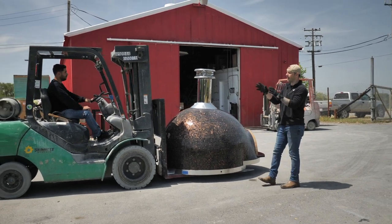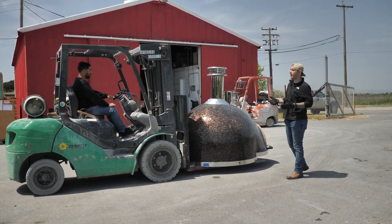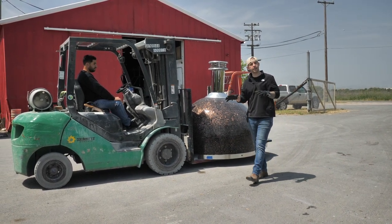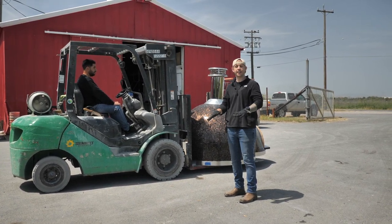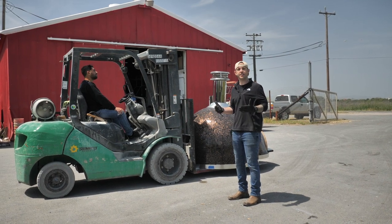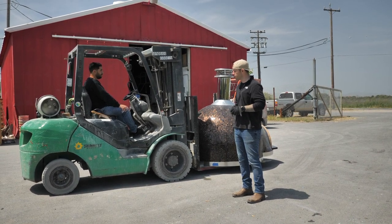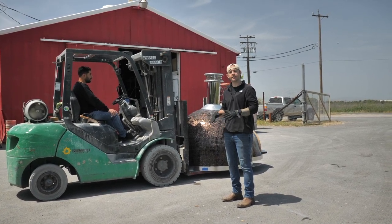Keep in mind you've got about 8,000 pounds of forklift and 3,000 pounds of oven — that's 11,000 pounds. You really want to make sure you're on a level surface, and just as importantly, make sure you're not on dirt, mud, gravel, pavers, or anything that can sink. There's so much weight that if something gets stuck or you start sinking, there's not much that can help you. We highly recommend you never do this on any surface that's not level, hard, and compact.